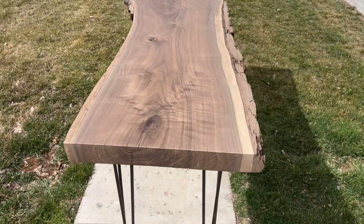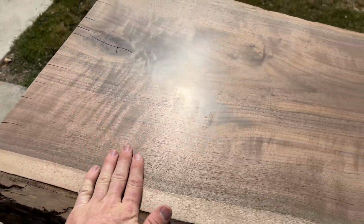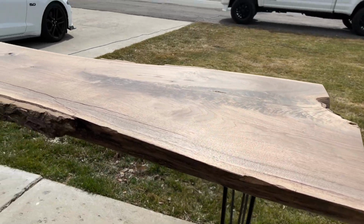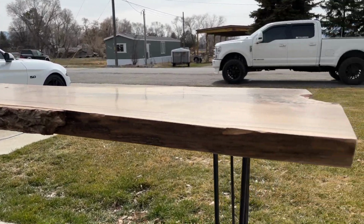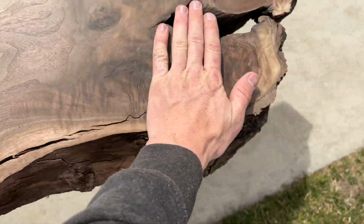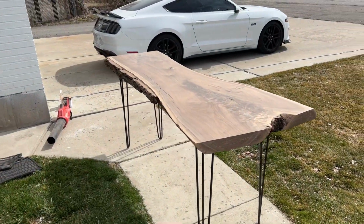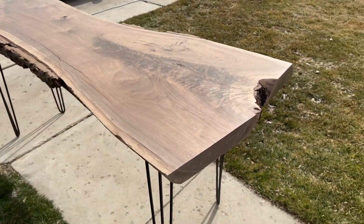Alrighty guys, so I went ahead and knocked everything out with 1000 grit sandpaper, and honestly, you guys would probably think that there was some type of sealant on top of it if you didn't know that there wasn't. It's looking really good. Got this one knocked out with one final last sand too to get all the little scratches out. Now I'm gonna go ahead and get the polyurethane mixed up, pouring through the filter and ready to go, and then we're gonna get it laid on.